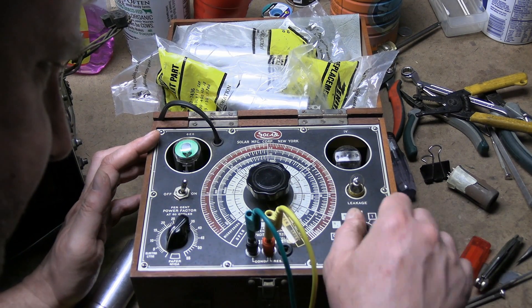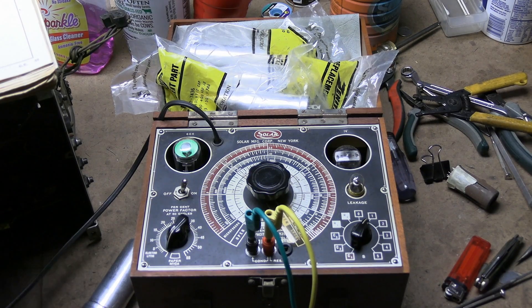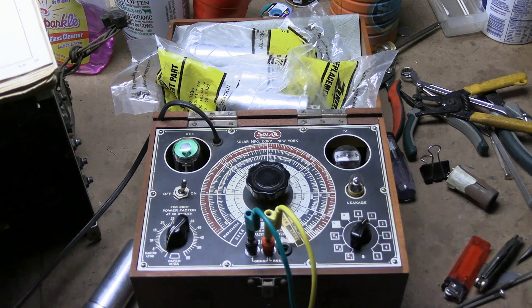This should be good to 350, so let's go to 100 and see. It lit up but then it faded out — that's a fantastic sign. Let me do this in complete darkness. Taking longer, but what that means is that's what a healthy cap will do. It means there's current flowing while it charges up, and once it charges up current flow stops and the light goes out. That's an excellent sign.